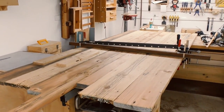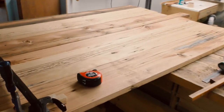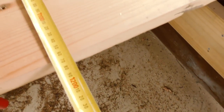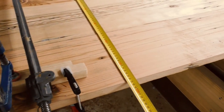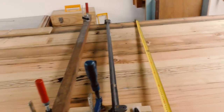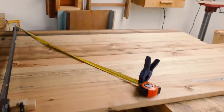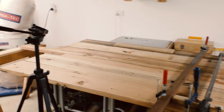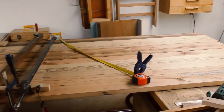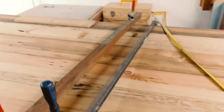So this is basically how big the door is going to be — I've laid it across my table saw and my workbench to have it fit in my workshop. It is just a little bit too wide, being 1,165mm, but I actually need it to be 1,120mm. In past projects I probably would have just glued it up and ripped it to width later, but for this 2.6 by 1.2 meter door, it's just not practical to rip it down in my workshop once it's all glued up, so I'll have to rip some of this timber beforehand.